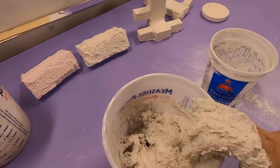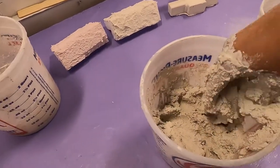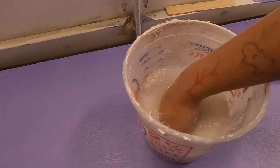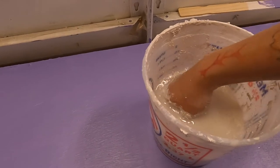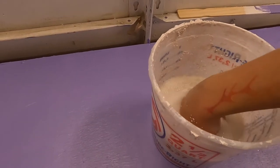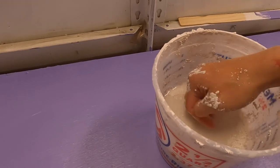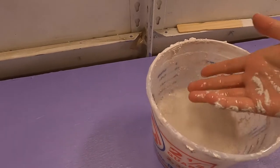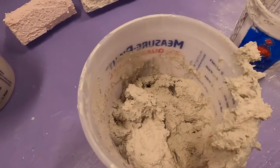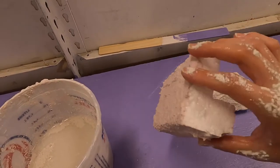It's really good to experiment. This bag goes a long way — one bag can cover around 300 to 392 square feet; you can check USG's website for exact coverage. You never want to put any plaster-based material down the sink. Small amounts of residue on your hands is fine, but never pour anything down the sink — it's going to mess up your drain. This consistency would be great for coating styrofoam and then waiting for it to cure. You can put additional coats on.